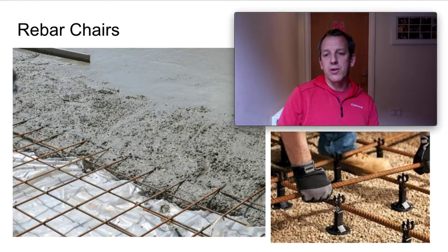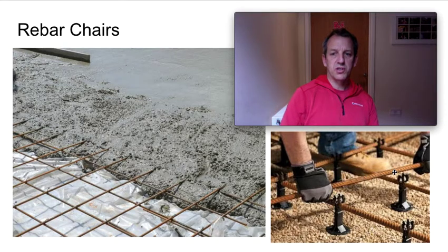The more common way of doing this is using a rebar chair, which is this little plastic thing. They come in all sorts of shapes and sizes. You can get metal ones with their feet dipped in plastic so the rust doesn't travel up through them from the soil. In this picture we've got a steel mesh rather than individual rebar — this is number eight rebar. Don't worry about a bit of surface rust on there because once it's encased it won't rust further, and we want rough steel so the concrete will bind to it nicely.